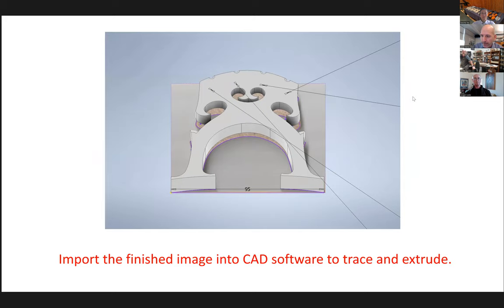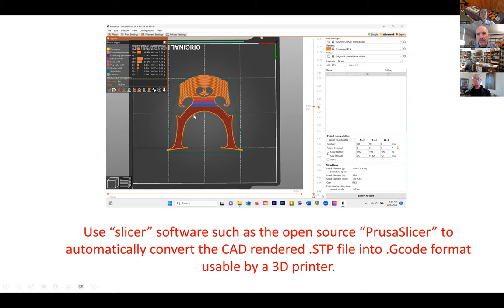Most of the structure in something like this, most of the stiffness comes from the outer shell, just like an I-beam in building a house. They have beams that don't need to be solid because the strength is in the shape of an I profile. It's slightly different, but if you try to bend a 15% infill bridge and a solid bridge, it's remarkable how close the stiffness is. There's not much difference at all.